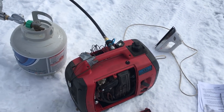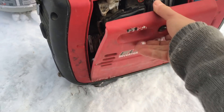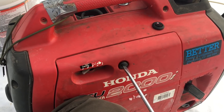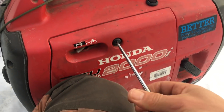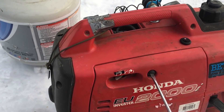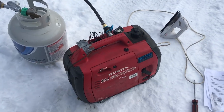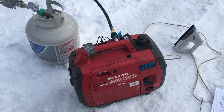Most of the time you just need to charge some batteries or maybe turn on your freezer. A Honda EU2000 can handle the surge load on a deep freezer's compressor, and then it can easily run more than one freezer. You flip on breakers intermittently — start the generator with no load, then start one deep freezer or fridge, then start the other.